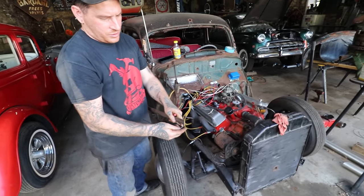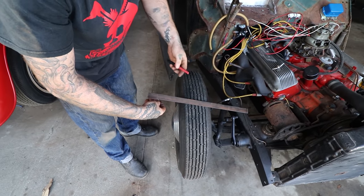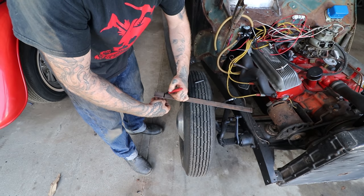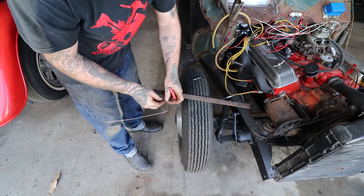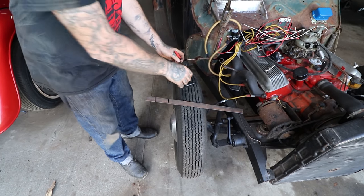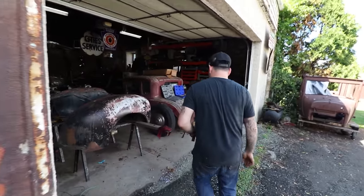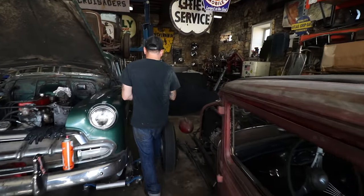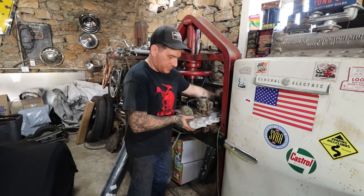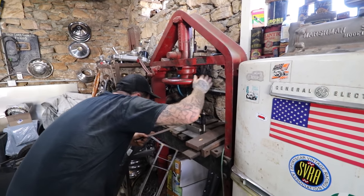It just gives you where you need to be. We can now just measure, take our bracket, and measure where the bend needs to be. If we were building a show car or something elaborate, we'd probably be much more careful. But we can roughly put our bend there and that'll get us pretty darn close. We'll walk it over to the press brake and bend it up. Apparently it's holding flathead intakes - you know you have too many intakes when your press brake becomes a display cabinet.